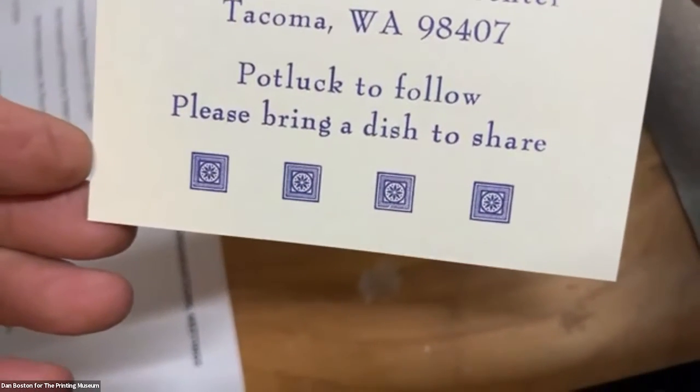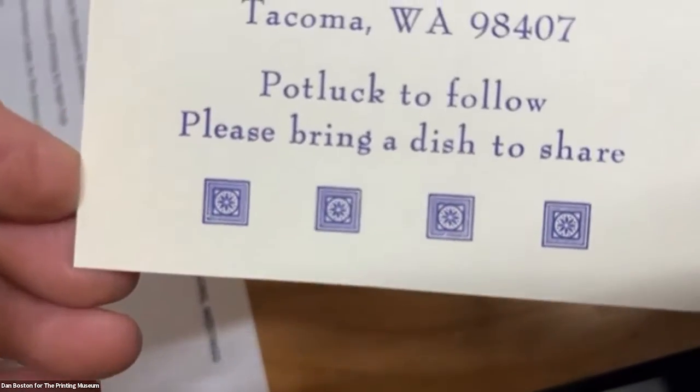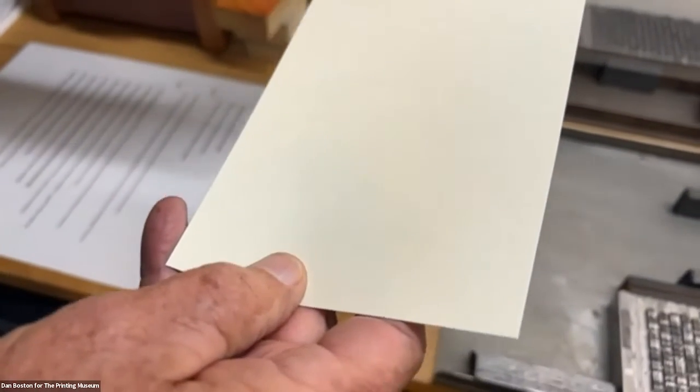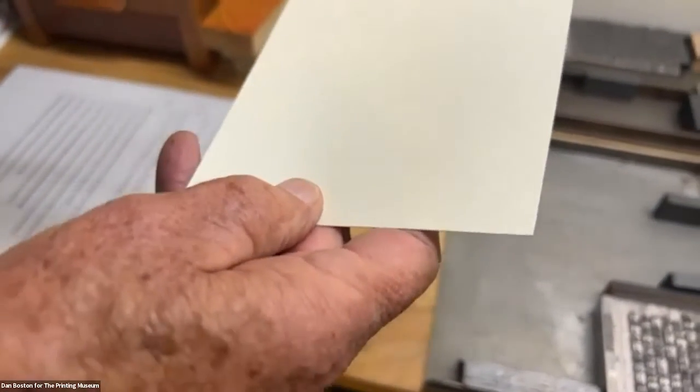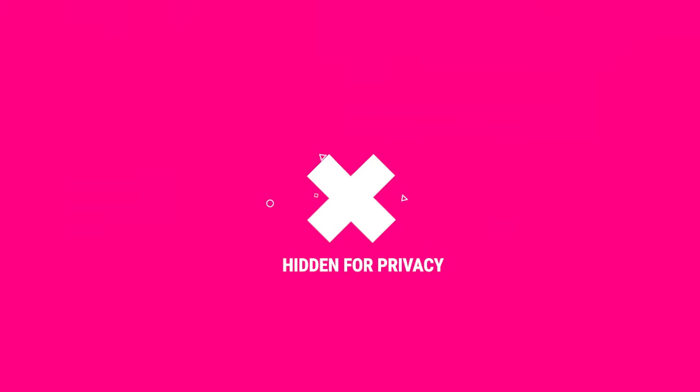It's hard for you guys to see, but he's got these beautiful ornaments that have very fine details, and the Kelsey is printing those. Perfect. And look at the back. The objective of fine printing is not to emboss, not to push that type into the paper, it's called a kiss impression. That takes some experience to be able to do. That's when the type behaves best. And you can see there's still that little bit of variation, like that E is just slightly heavier.